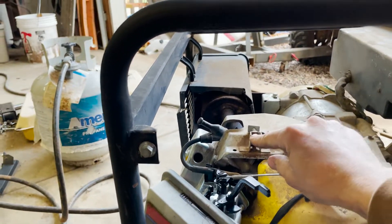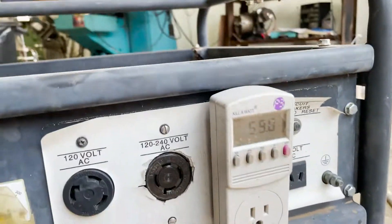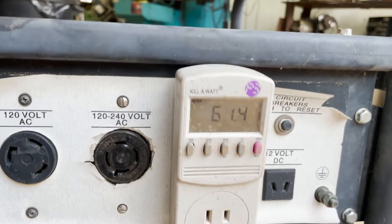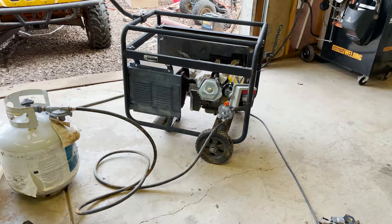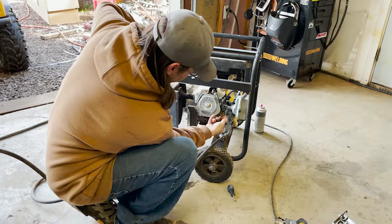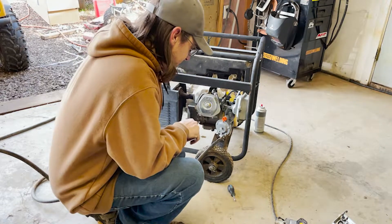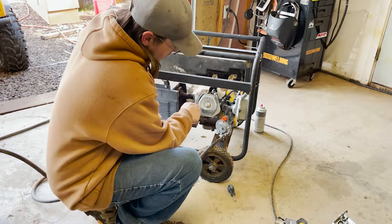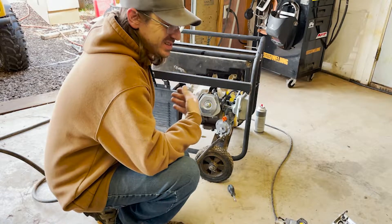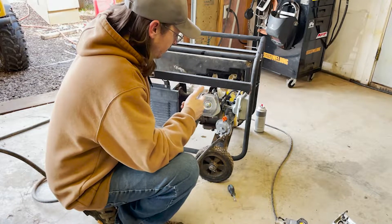I adjusted the idle — the handle on the load speed here, you can turn up and down the RPM — it's bouncing around. So after some tweaking and tuning: basically this needs to be counterclockwise to the stop for propane. And then you've got a little brass screw right here that you're going to have to put a load on the generator and just kind of finely adjust it — give it a chance to balance out, so don't adjust too much too quickly, it's going to take a second to settle down. It's still hunting a little bit with a load on it. Let's go ahead and fire it up and see what happens.